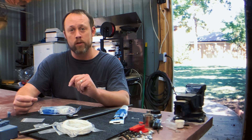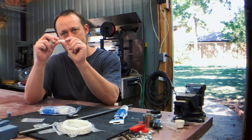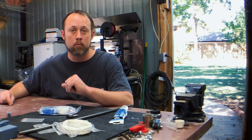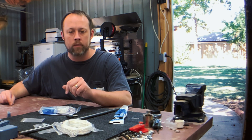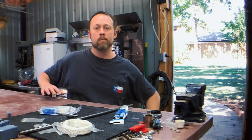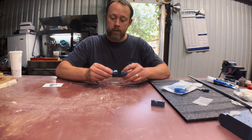This is all an experiment just for the switch for the pneumatic cylinder. The gasket I was actually able to cast has air bubbles and sheared on the way out, so I'm hoping there is some tensile strength to this Quicksil. If it doesn't work, I'll have a plan for using O-rings on the switch instead. And if that doesn't work, I'll just buy an industrial switch — which would be admitting failure on making a 3D printed valve — but maybe it'll be an evolution in process. The last mold was redeemable after I pulled the piece out because the Vaseline release worked pretty well.